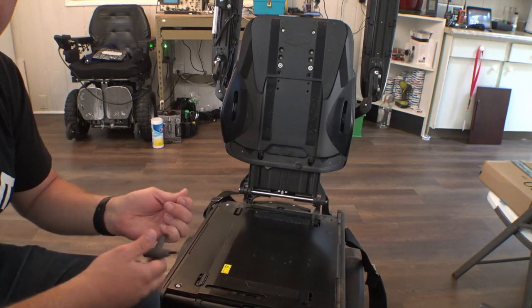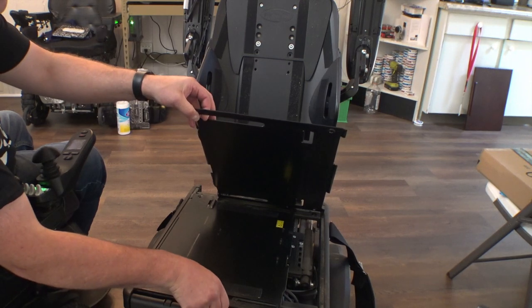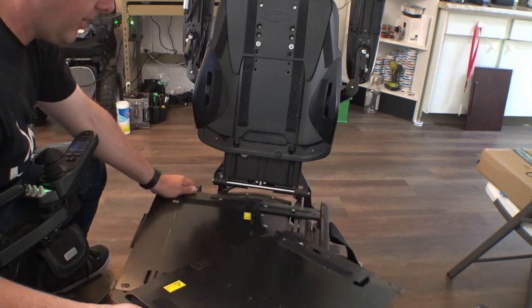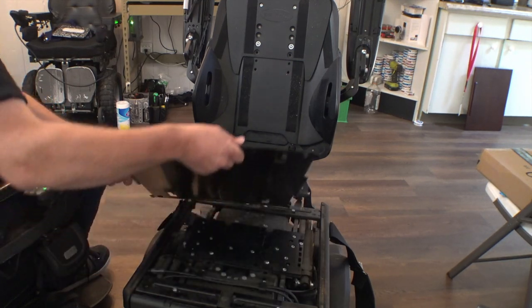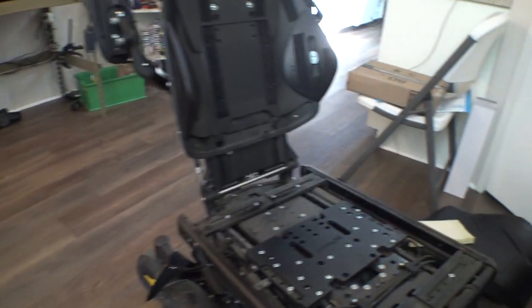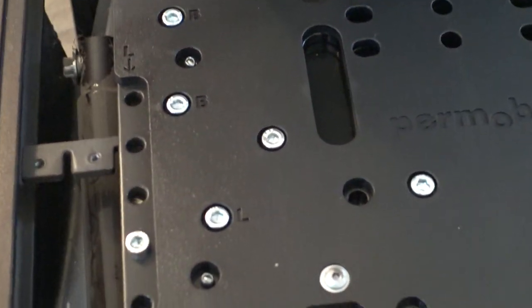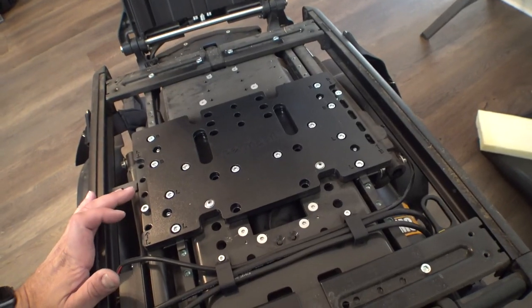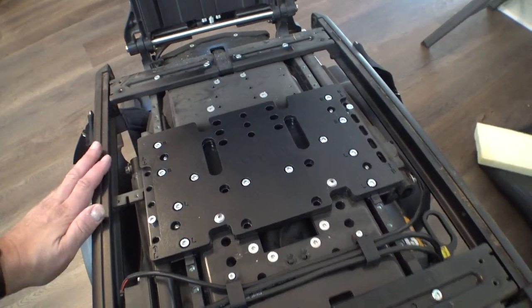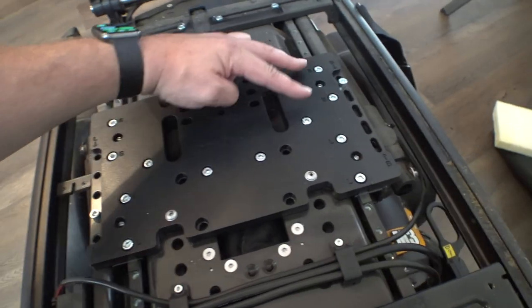We're going to take off these four screws that hold the seat pan on. There are two sections that overlap with each other — that's how they're able to set the width without needing a new seat pan. These just slide back and forth and accommodate whatever size you select. Looking down at the base plate, there are labels: L's on some, B's on others — B for back, L for leg rest. To pull the leg rest out or scoot the seat back, you remove the screws associated with that.